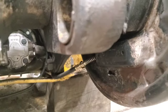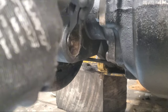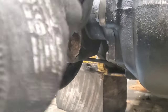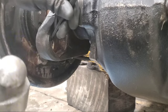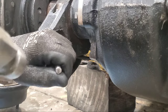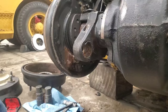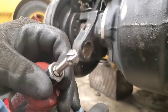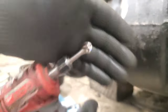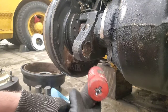My overall goal here was to fold in the bushing since it's split and just peel it out of there, but that did not work in this case. You know what they say, there's always more than one way to skin a cat. My next option is using these non-ferrous burrs — get in here and we're going to carve this out just like that.